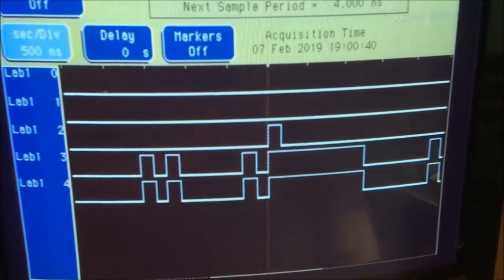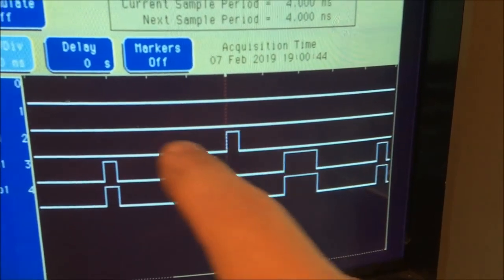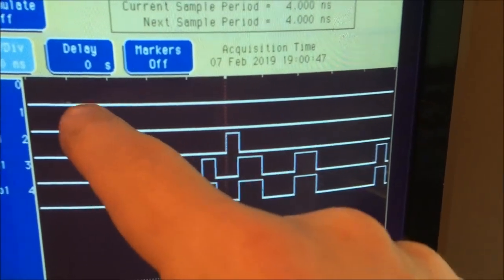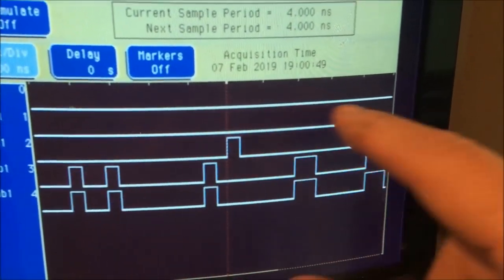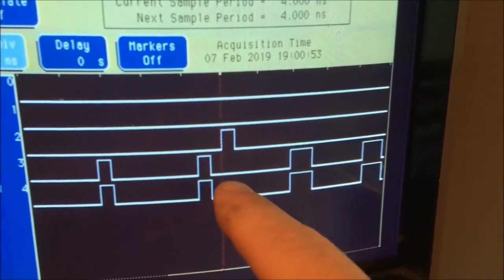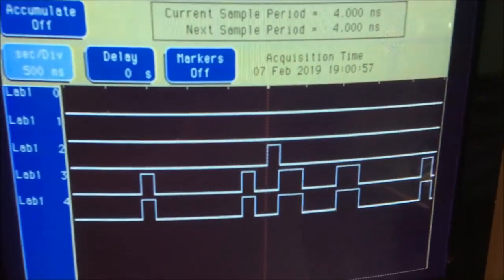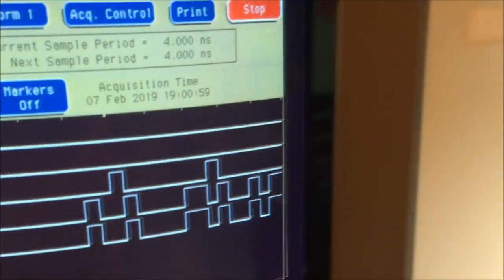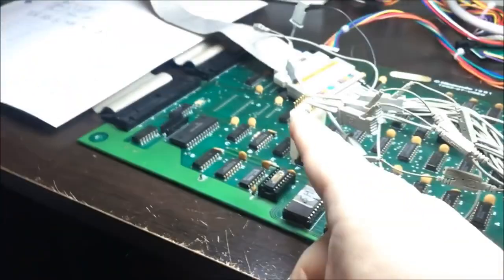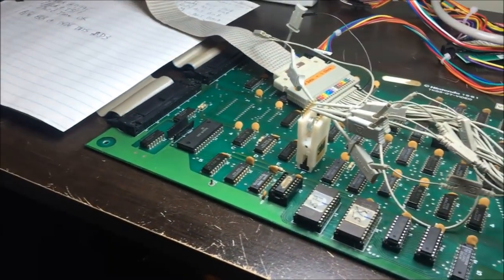I shouldn't say it's always selecting the 1 line. It's always outputting the 1 line, even when it's being told to output the 0 line. It's supposed to be outputting 0. So this should be down here; instead, this is. I'm going to go ahead and continue, look at the other switches in that mux. I'll be back.